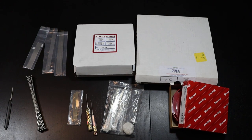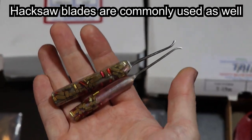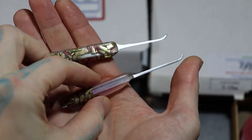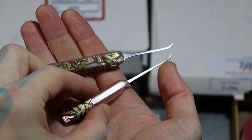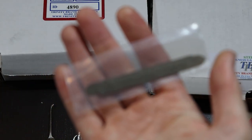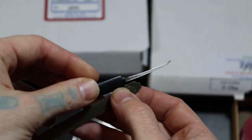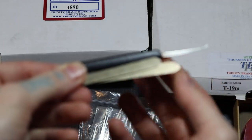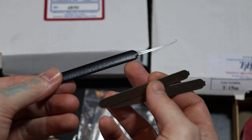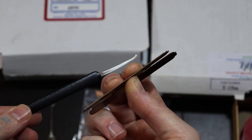For pick metal, the cheapest option is windshield wiper blades. Here are picks I made with epoxy handles using windshield wiper blade metal — you can see the thin one on the bottom going through the handle, and a thicker wiper blade used for the top one. Another option is repurposing used pick handles: when your pick is bent up and done, cut the tip off, remove the plastic dip, and the metal left is perfect for making a half-tang pick.